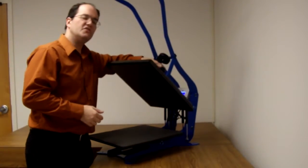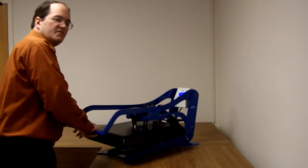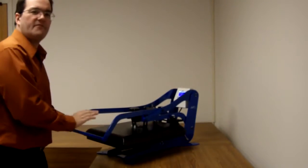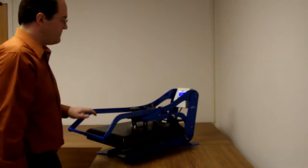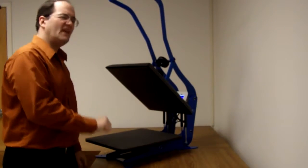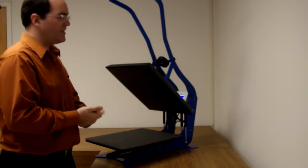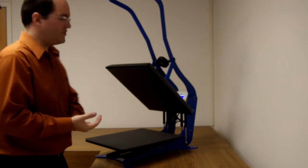You can turn it a little more, and what I find is it's a little bit too difficult to press with one hand, but nice and firm for two hands. That's exactly what you want. You want a good two-handed ka-thunk, and to say to yourself, it's a little difficult for one hand, but a firm two-handed pressing. That's the most practical way of setting your pressure.